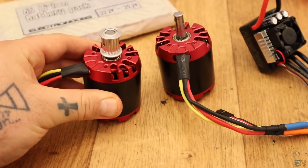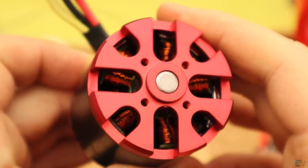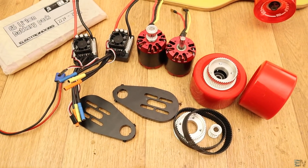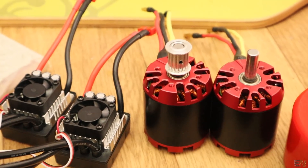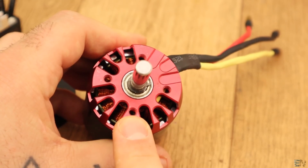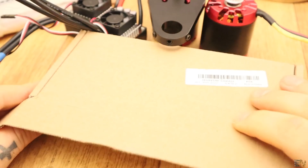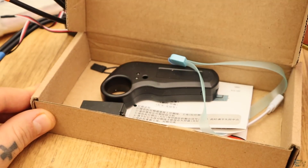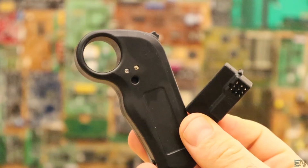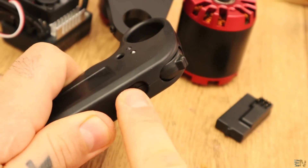For a powerful motor, I went with the N5060 outer runner brushless motor. It is very powerful and it is a 400kV one. I have 2 of each of these components since I wanted a double motor electric longboard, to be more powerful and with a lot of torque. This motor has holes for the screws and fits perfectly on these motor supports. Finally, we need the radio transmitter and receiver. I ordered a mini 2.4GHz remote controller that has a 2-channel receiver. The knob can go both ways and it also has a switch in case we want to add front lights to the longboard.